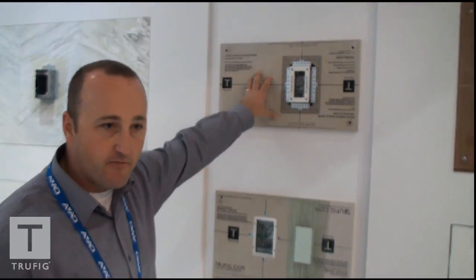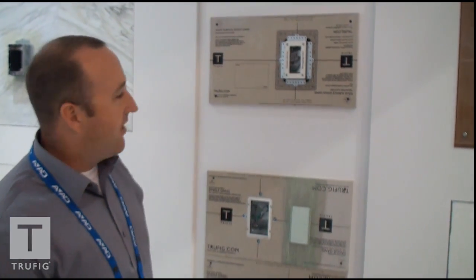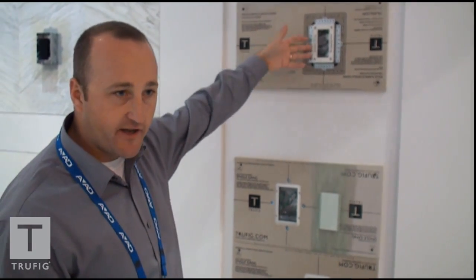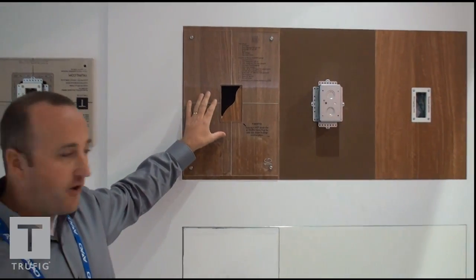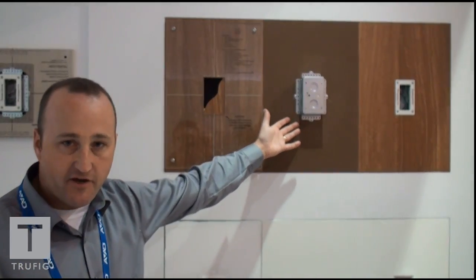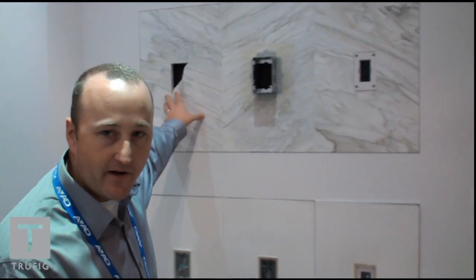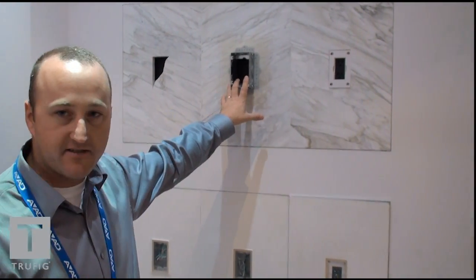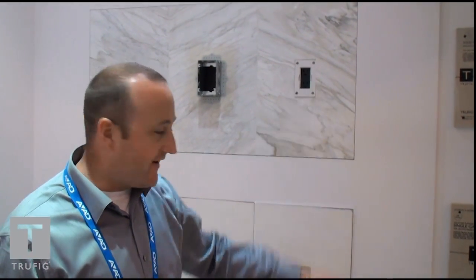We have a mounting platform that inside of that has an electrical box or really any enclosure attached to it. Our installers will mount this platform and then coordinate with all the other trades, the electrician to get it wired, the carpenter who has templates to cut out the opening, so we can walk through the process of how you secure that box to the back, and also working with the stone and tile and granite people to have a similar type opening where we would ship them an AutoCAD file that use a water jet to cut that out, adhere the box to the back, and then would flush out the front of the plate with our devices.